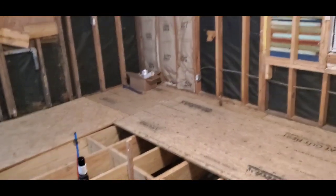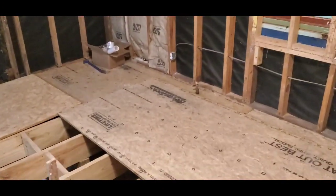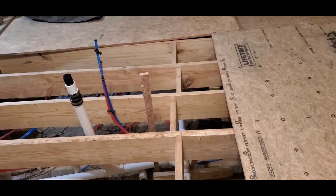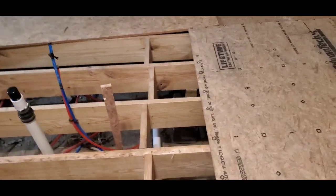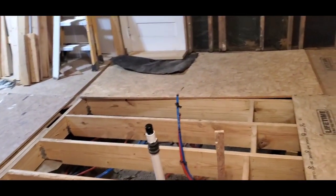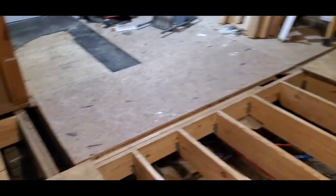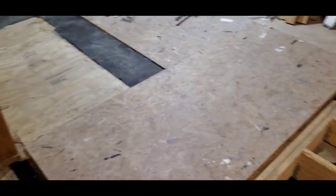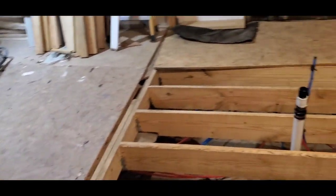He's pretty much cleaning up a lot of the wood around the house so that as we wrap this project up, it won't be a hot mess outside before he takes off. Here's an update of what we did today. We did cross bracing — bridging — on the middle of the floor. We didn't get a chance to do the top flooring because we started working on this side. All of these boards right here are temporary boards; they're not permanent. I just laid them down so that I can get to my door.